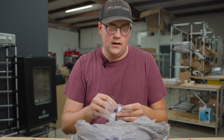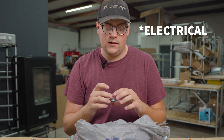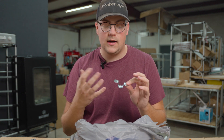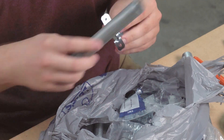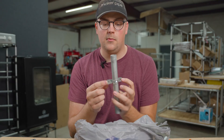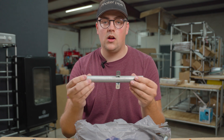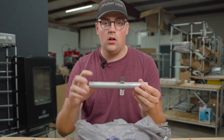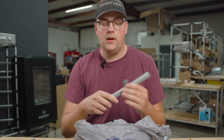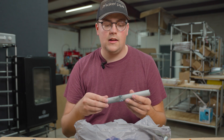Next is an accessory that we often see used in DIY builds, but of course it's designed for EMT applications — this is called a two-hole strap. Make sure to get the correct one for the right size pipe or EMT. This two-hole strap snaps over the conduit and has tabs with holes pre-drilled in them that you can use to secure it to a surface. If you're doing electrical work, this is used to secure conduit to a wall or ceiling. We also see it used in DIY builds for attaching wood for shelves or desktops.